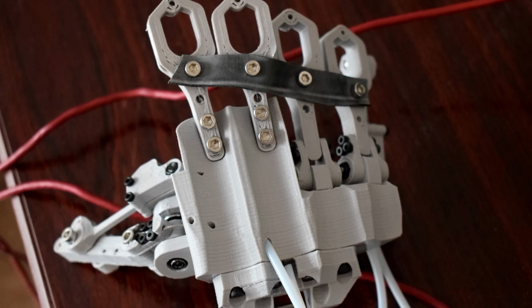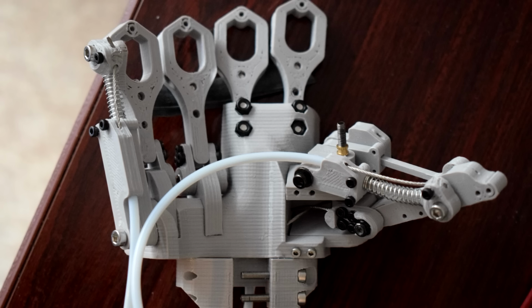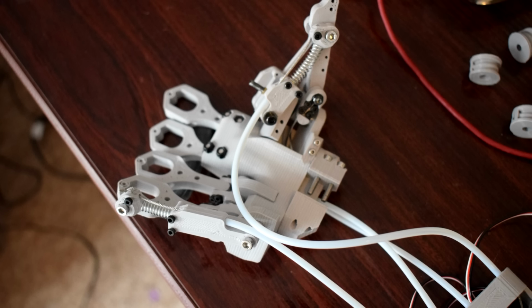So this is the one thing that just didn't really work, because I'd used a little bit of inner tube going across the knuckles to be the elastic thing that would return it back to a neutral position. The inner tube wasn't really good enough for bringing it back, and it just made it more difficult to actuate. Something that more directly opposes being bent, like a little strip of spring steel, would have been a lot better in place of that inner tube.